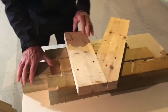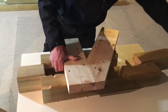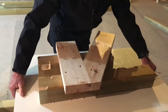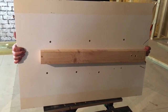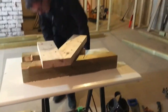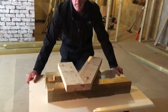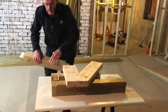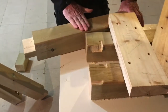The way this works is we started off by making a jig, and this jig will do all of your tenons — so if I just take that apart for now. The first thing you need to do is get a nice flat board, and on the underside just put a piece of timber, anything you've got lying about — that just enables you to slot that inside a Workmate and tighten it up so it's nice and stable.